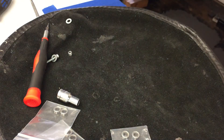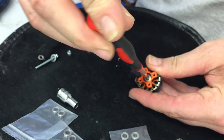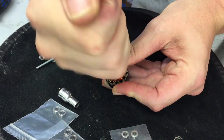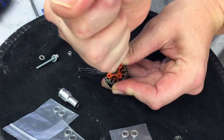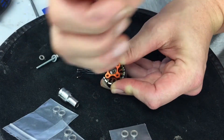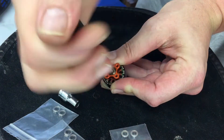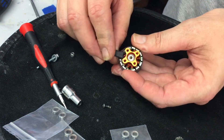This one's already been heated up just a little bit, so I'm going to go ahead and take it out very carefully, turning it with lots of pressure going down. If you're going to strip it out, this is when to be very careful. Don't use an allen key — use a driver like this. The chances of you getting it sideways and stripping it are higher with an allen key.